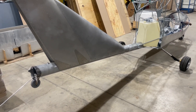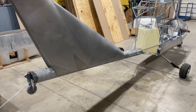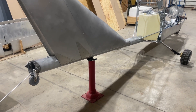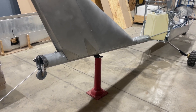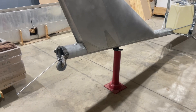The tailwheel is used when the aircraft is unoccupied. With the engine on the back, the weight will be behind the center of gravity, so the tail will sit on the ground. My kit came with a boom stand that, while in storage or in the hangar or out on the ramp, will lift the tail up so it doesn't sit on the ground. But out in the field when you're flying and landing at runways, you don't have to pack one of those around — you can just drop the tail on the ground and the tailwheel will keep the boom off the ground.